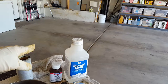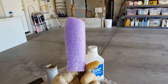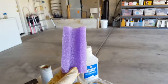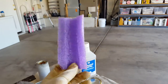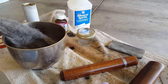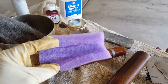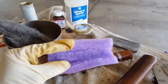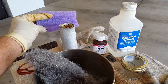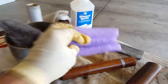I'll tell you how I did the self-stick — I'm actually feeling pretty good about myself here. I went over to the grandkids' house and they had some of these little noodles they use for playing in the pool. I took one of those noodles, cut it in half, and that little groove right there I used to sand the hand grips. The groove is about the same size as the hand grip and it's very flexible, so if the hand grip is a little bigger in one spot, it flexes. I took the wet/dry sandpaper, stuck it sticky-side to the noodle, and it formed right around the piece.